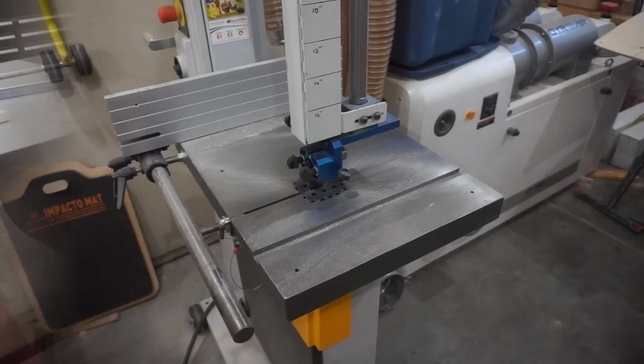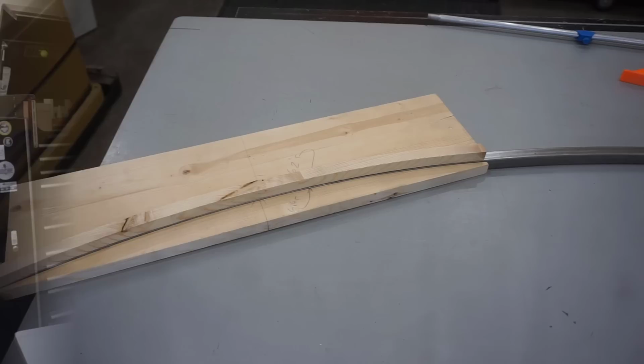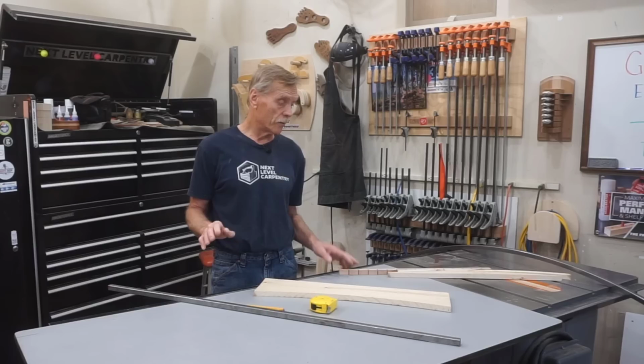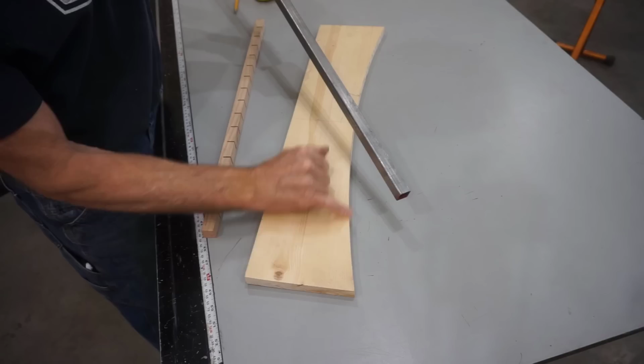And you can see here how the templates I just created match up to the curved ramp on the Groat and to the piece of curved square tube my friend Justin rolled into shape at his shop. I freely admit that I've got a lot more experience bending wood than steel, but they're really not so different as you might think. So I'm going to walk you through the process to show you how a carpenter can curve steel. I started by taking this square steel tube and putting it up against the curve on the template.